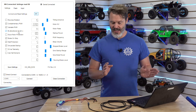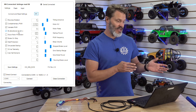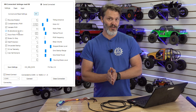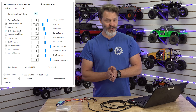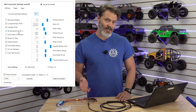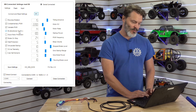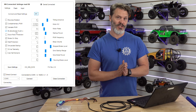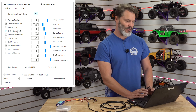Bi-directional is when you have an ESC that will go forwards and reverse, and in this case it also gives you an arming point in the very center for ground use. If you wanted to use this for UAV, or maybe for an airplane, you would uncheck the bi-directional box and then you would have normal single direction rotation. But for crawlers you want to keep bi-directional.